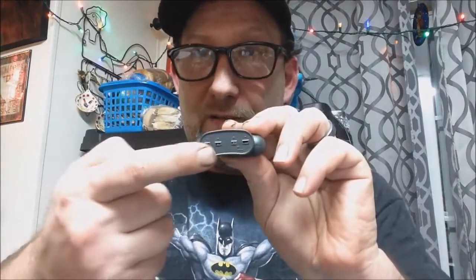It comes with two K-type thermocouples and it can do two at the same time. You just take the probes and put them into the connectors on the multimeter. The reason you'd want that is so you can take one temperature reading and another temperature reading and compare them — you can compare temperatures in two different areas and come up with an accurate reading.